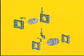The telescopic pipe is fitted either to the guide shoe or to the crosshead pin. If the telescopic pipe is fitted to the crosshead pin, it must be disconnected and suspended before removing the piston and piston rod.